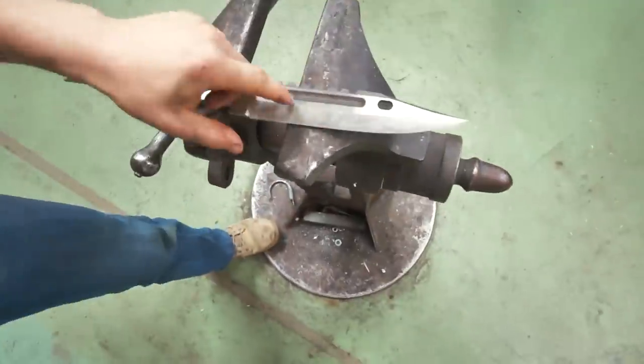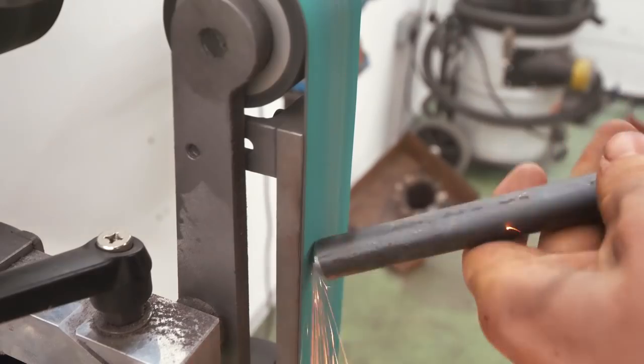No, it's called editing. So first things first, we're gonna get in there with some sandpaper. I'm gonna make myself up a little tool that I can wrap on the sandpaper that matches the radius of that cutter, 16 millimeter radius, and then we'll be able to work that. Polish it up nice and neatly.